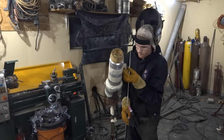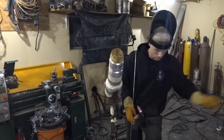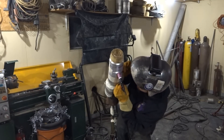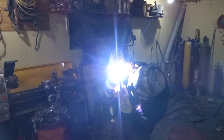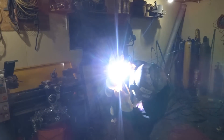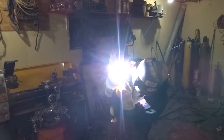Now, if you notice there's a couple things wrong already. Masking tape contaminates the aluminum. The foam pig contaminates aluminum especially the material it's made out of — if it starts getting hot and smoking, the smoke contaminates the aluminum. That contaminates my gloves, which contaminates my filler metal, which is being fed into the pipe. I don't have aluminum tape at the moment — I just kind of ran out. Also, I'm not using brand new brushes or a brand new stainless hand brush. But this is just for practice.